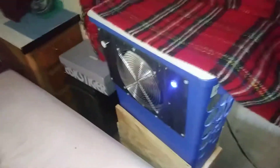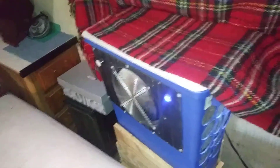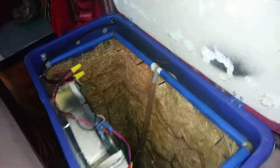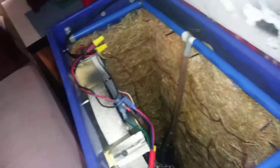I'll show you the inside of it. What I did to make it real easy to service and fill up is I made a lid out of this FRP — you can use anything you want. Put it on some hinges and made sure it fits flush. I've got a 12 volt pump and a 12 volt fan, but you can use 120 volt, whatever you want.